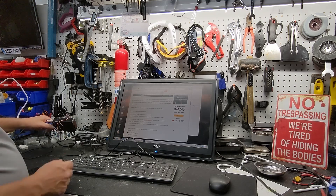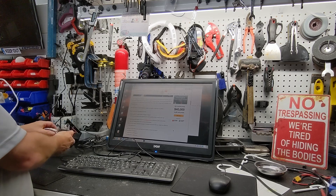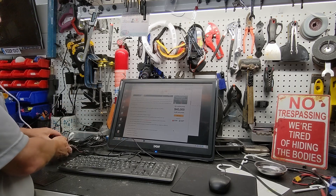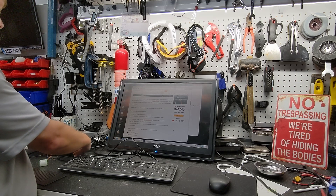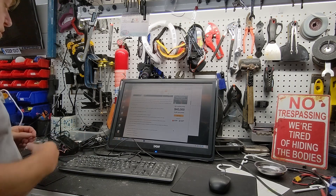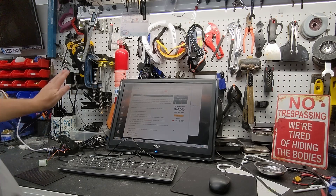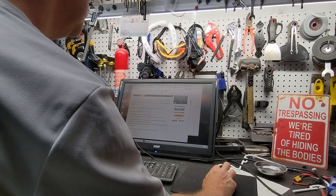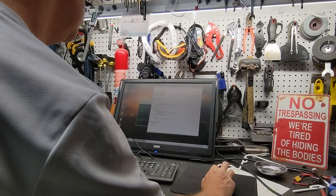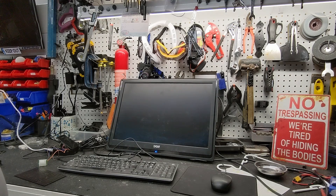It's all based around a Raspberry Pi - this is a Pi 4, you can use a Pi 3 as well. It's got a PIR sensor, and I've also got a camera on it. One thing I might do is randomly switch the camera on and put people who are looking at it up on the screen. The first stage is to get the Pi going, then run a little Python script - it plays a video file triggered by the PIR and off it goes.